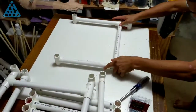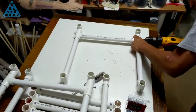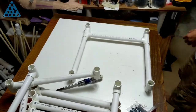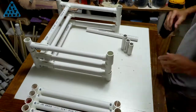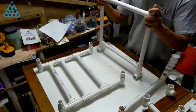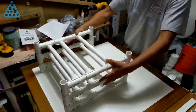For this part of the construction, I have to make one of the sliding rails stationary or non-sliding. This rail has to be screwed to the frame to prevent the frame from collapsing, due to the ability of the rail to pivot and slide. I'm going to secure the rail as far to the end of the frame as possible to allow as much room as possible for computer parts. Be sure to level the frame to a flat surface before screwing the stationary rail in place. I can now construct each level with three sliding rails — one of which is stationary — and the end cap. For now, I'm using a short stud of PVC pipe to hold each level of framing together until I get a better idea of how much space I need within each level, at which point I can cut the PVC pipe to the appropriate length.